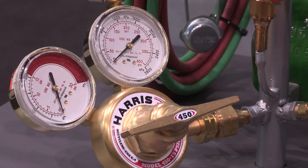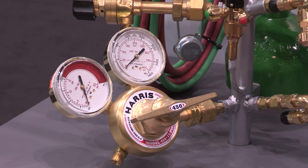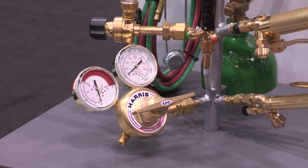Is the offering custom to the customer? These are commercially available items. We just need to know what fuel gases the customer has available and then we'll supply the torch and the tips designed specifically for that fuel gas. These are designed for natural gas and utilize an injector style mixing so that it mixes the oxygen and fuel in the proper ratio to give you a perfect flame at the end of the tip so that you're able to cut.